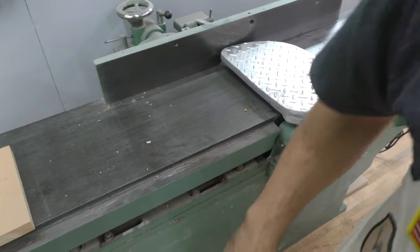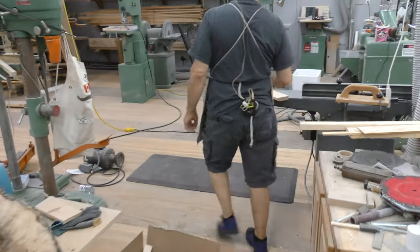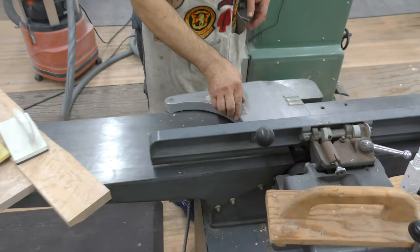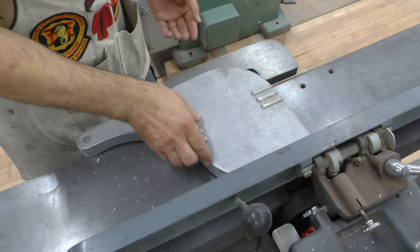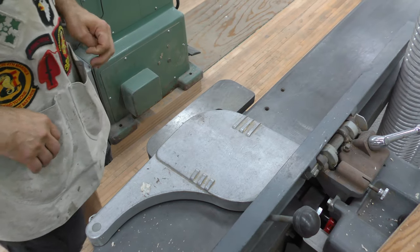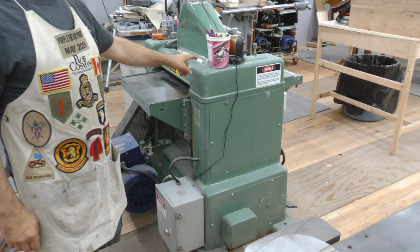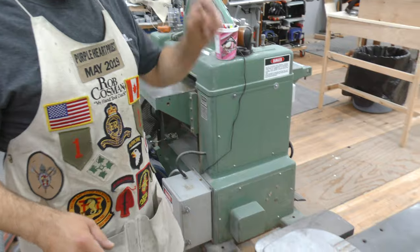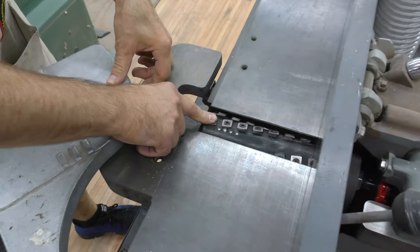I want to show you the one we just did. This is on an 8-inch Delta. I've also done a General 8-inch jointer which was really easy — literally just had to take it out, put the bearings on, put the blocks on, and there were two screws on the bottom, one on either side. It probably didn't take any more than 20 minutes. I also replaced the head on my 20-inch General thickness planer; that was a little more involved but it wasn't terrible. This one was quite easy. So there's your 8-inch head.